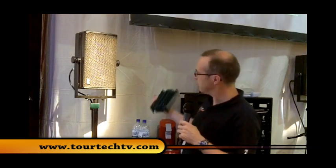The different products we have are based on three philosophies. One is point source, as you can see here. This is a typical 8-inch with a high frequency driver unit, and it features a 401 Pro Ribbon driver, 800 watt peak power handling, and an 8-inch bass reflex loaded box. It's actually a system that we would call our reference system because it's very compact, first of all, but it sounds actually as a studio monitor. So in that sense we call it the reference monitor.